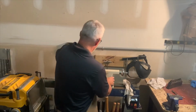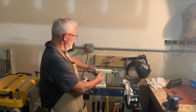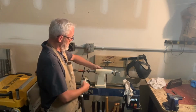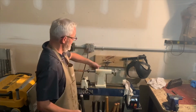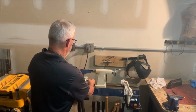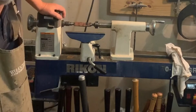We've loosened our lathe up here. We're gonna push it all the way down so it's all good and tight there. The next thing we're gonna do is actually lock it down. So this is locked good and tight. I will then loosen up my actual extension here, kind of tighten it good and tight. Tighten this back again. Put our tool rest or our arm on there. And now we are ready to pick a tool and actually show you turning this thing.